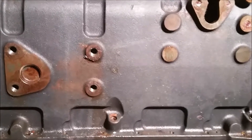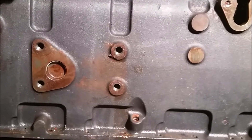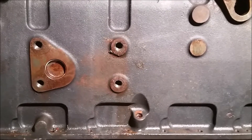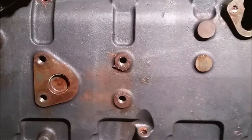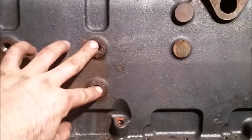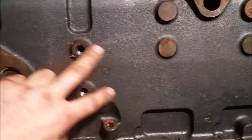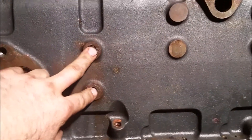This is a long-awaited video covering what fabricating motor mounts for common rail conversions looks like. This is a 12 valve block with the standard four holes — this is a non-storm block. A storm block would be a 12 valve block with two extra holes so it could be mounted in the later style, like 98 and a half and up body.